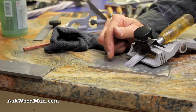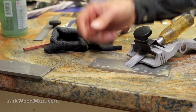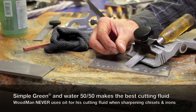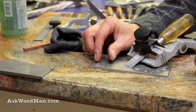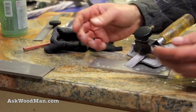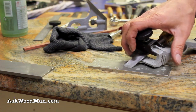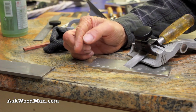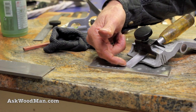It's very nice to be able to sharpen. When I first started to sharpen, I used WD-40. Oil makes no sense as a cutting fluid because oil creates a sliding space. What you want to do is actually reduce any sliding space and bring that knife down to that diamond as close as possible. The cutting fluid is for flushing the chips away, flushing the waste away. So oil is the worst cutting fluid you can use. I see people use it all the time and I've never understood it. Oil creates a sliding space — that's why you put it in your engine, because it creates a space between moving parts that have friction. So why would you think it would work between two pieces of metal?